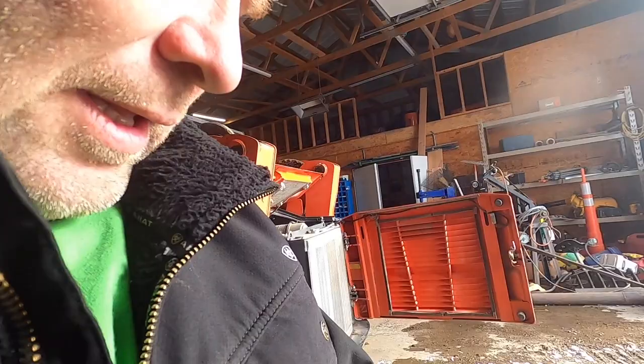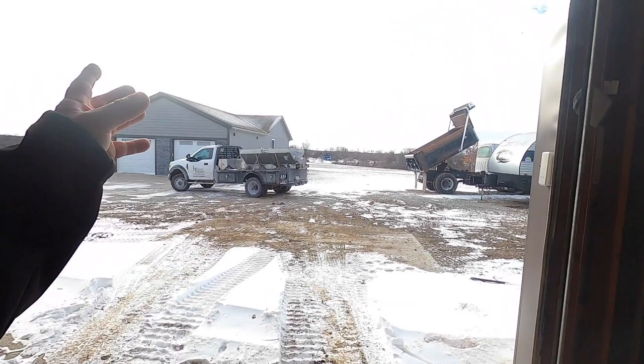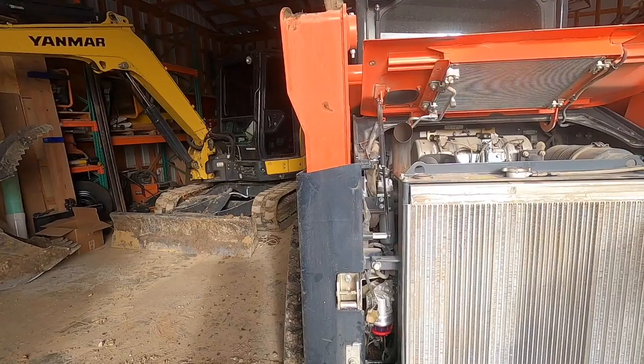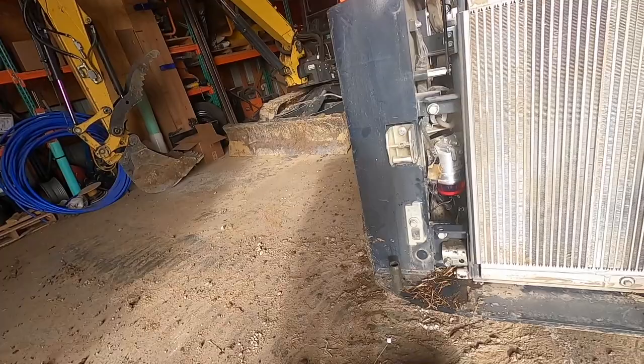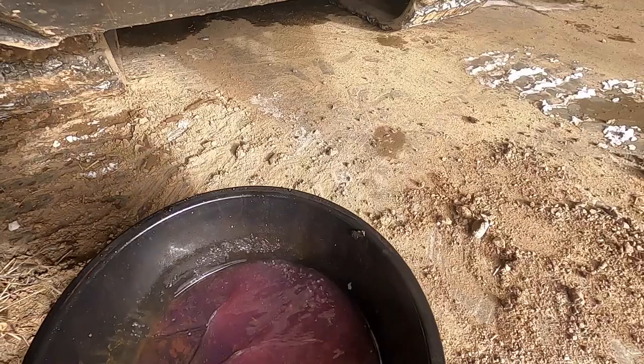I had the touch of death on my machine. I started up, ran down the road for a little bit, let it run in the shop. It's sitting in the shop — it's about seven degrees, feels like negative 12. I always treat my fuel, I always change my water separators when I change my spin-on filters, and my filters have less than 100 hours on them. But some of what was in it — obviously I got dirt — and if you see that milky stuff, that's water.